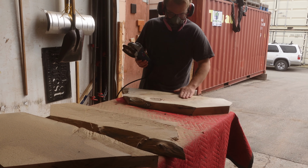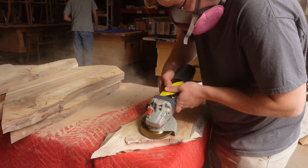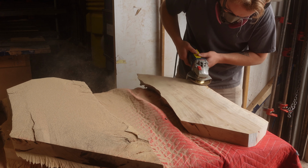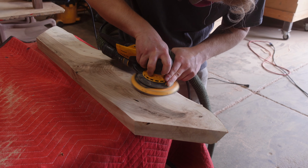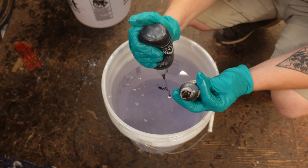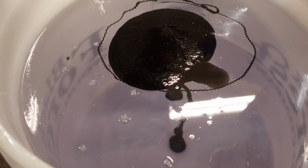Another tip that I can offer when you do have rough left on slabs and you have no choice but to leave it is to actually make sure that you're sanding out those saw marks, because in the case, let's say that some of that rough ends up on your top surface, you don't want to see, let's say, chalk lines, bandsaw marks, chainsaw marks, anything like that on your surface. You want to make sure you have a nice sanded surface beneath that resin. What this also does is, I found, it gets out a lot of the debris that can be trapped in those saw marks. So even if you plan on machining it all off after, we've had it happen before where we do a clear pour, we don't clean off the saw marks, and then you get like this brown residue that comes off of those saw marks.